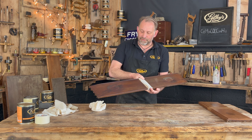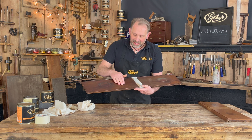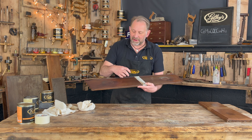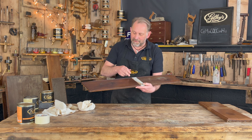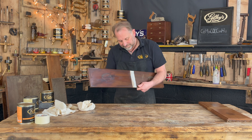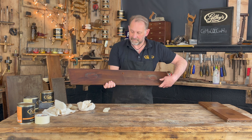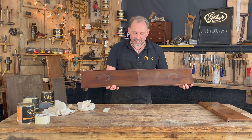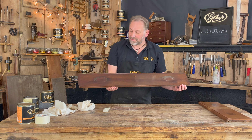Well that has made some sort of difference there. It's not quite as transformative as the walnut piece, but it's gone some way to satisfying the absorption of the wood. Like I said previously, it has got a finish underneath — an overbrush of something like shellac that's been slapped on. But it has made a difference. If I angle it a bit like that, maybe you can see — it's added a little bit of colour and revived the finish.